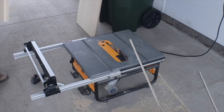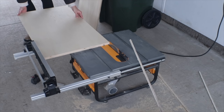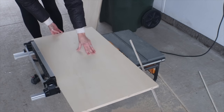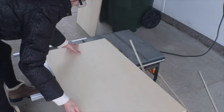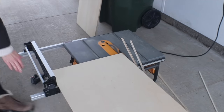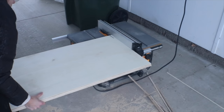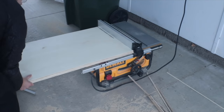Now let's get to work on the doors. I'm using three-quarter-inch plywood again and I'm ripping it on my table saw so that the edges are at a 30-degree bevel — I thought this was just a nice little detail to make the doors a lot prettier. With the exception of the two shelves inside the closet I only used two sheets of plywood total: one half-inch 4x8 sheet and one three-quarter-inch 4x8 sheet. The three-quarter-inch is in the back of the closet and the other half of that sheet creates the two doors. I'm ripping the other direction to get a bevel going on all four sides and I just love this look.